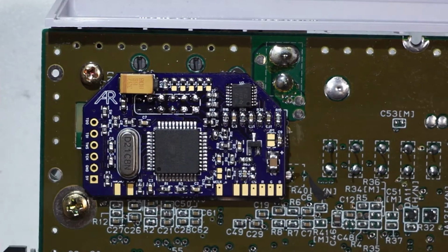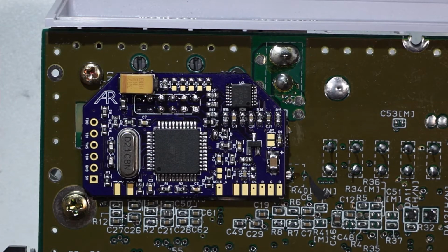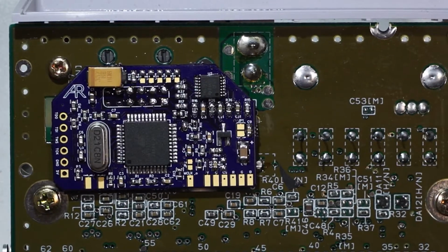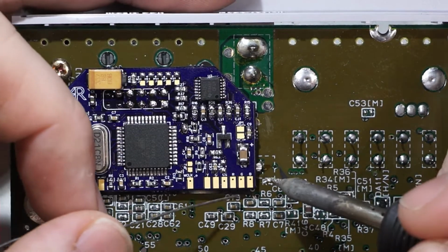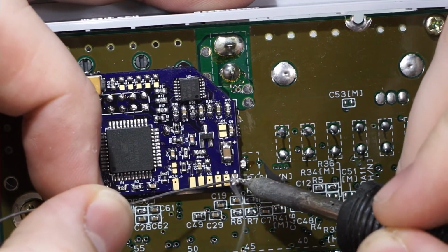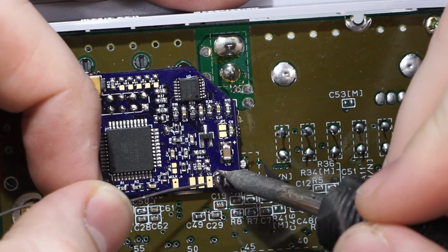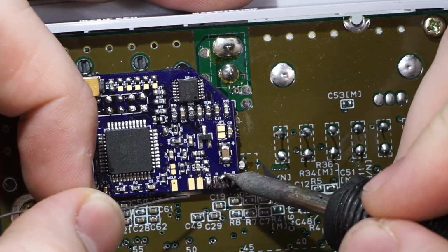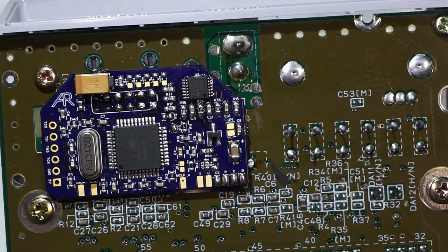On a future version of this, I'm going to eliminate the jumpers because that's another area that we already know. I mean, this is meant for the Super Nintendo Mini, so we already know what the jumper setting should be, so those will be eliminated. And in fact, the jumpers may not be needed at all on the newest revision of it because of how we're going to be modifying the C-Sync circuit. So that may be interesting. We'll find out.